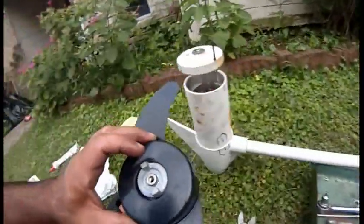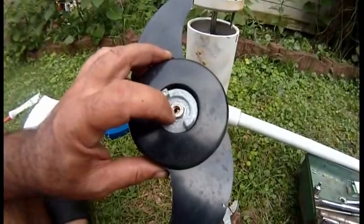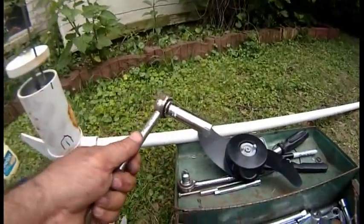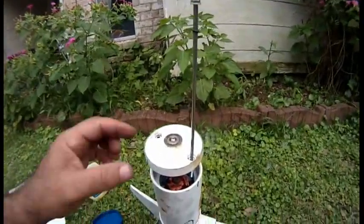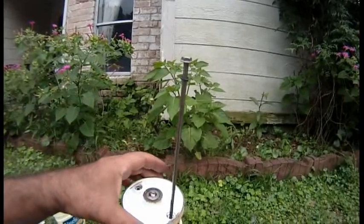Okay, YouTube, in my case, this was a half inch, and I used a ratchet. I used the ratchet to get it out. After that, you get these shafts out. There are 5/16. There are two of them. They do have a seal here.